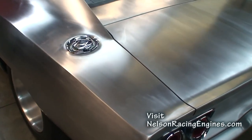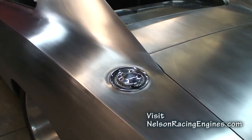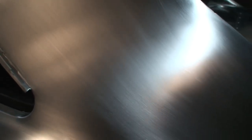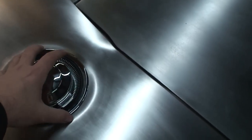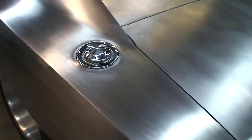Here's another slick view of the car. You can just see the slickness of the metal work — no body work done to this, this is all just metal work, fully welded. You can see the discoloration where the weld was — it's hard to even tell. This is a pretty good view where you can actually see where it was welded. This fuel location right here, of course when we widened it it would have looked odd, so we had to cut the location out, move it, graft it in, and then re-panel beat it.